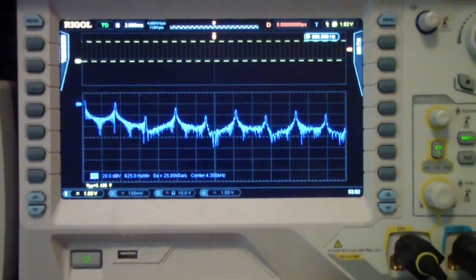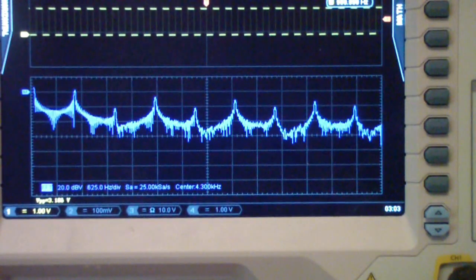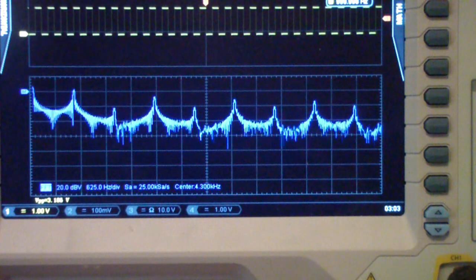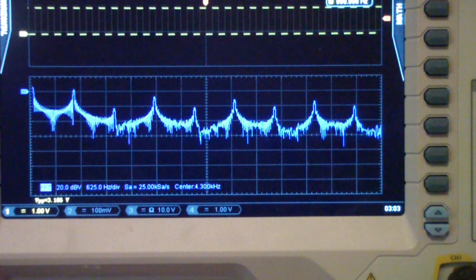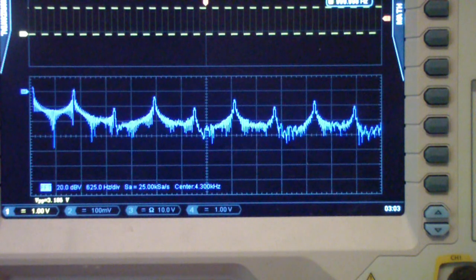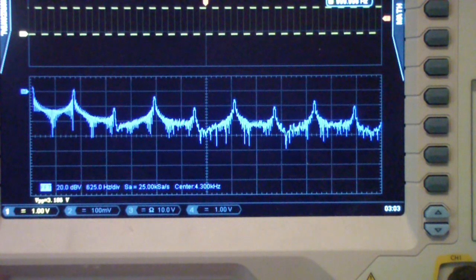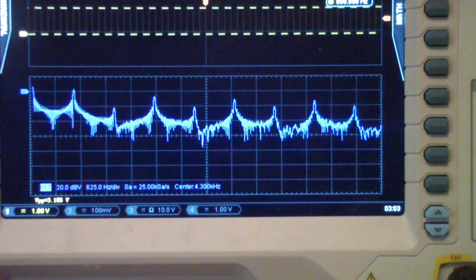This is a Rigol DS4000 oscilloscope operating in the FFT mode. And an oscilloscope, remember, is simply a device that measures. So with regard to things like scattering parameters, it can't measure scattering parameters because that requires a synchronized source of energy, of power. Remember, that requires that we put power into a port and measure the reflected power and the power out of the other port and so on.